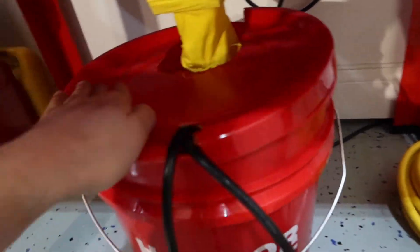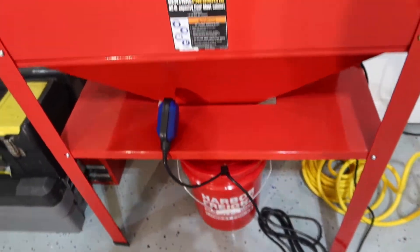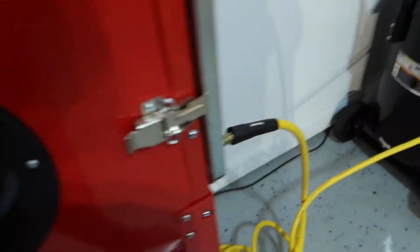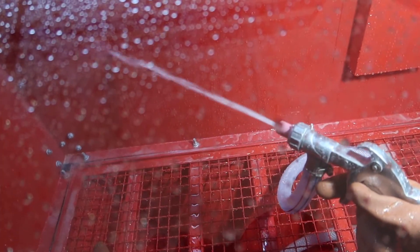Now that the hard part's over — putting everything together and hooking it up — let's put it to the test. I didn't pay for any of those YouTube video series. I figured I'd spend the money on parts and try to figure it out myself. Let's put the lid back on to keep anything from splashing, turn the system on — you can see the slurry coming out of the gun. Now let's hook up the air and introduce it — got the glass beads coming out, and now introducing the air to see if we've got anything.